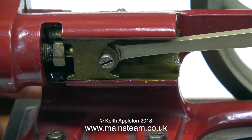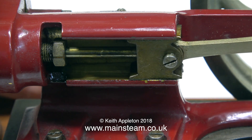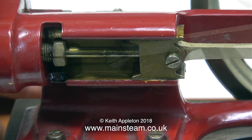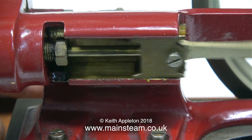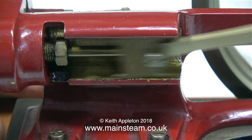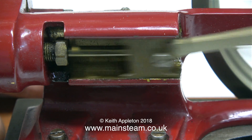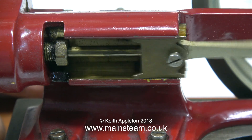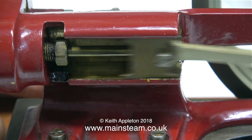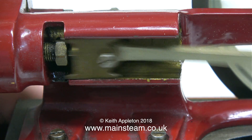On this particular Tangy engine, the valve timing is a little bit off, and steam has not been admitted until the piston is well on its way back. Although it seems to run okay, it's making a bit of a knocking noise. Most of this mechanical clunking noise is down to the fact that the timing is out. There's some play in the big end and some play in the small end, and as the admission is very late, it's the sudden change in direction of the parts that makes the noise — well, most of it anyway.